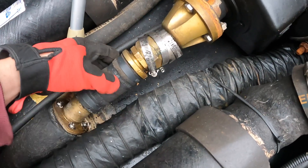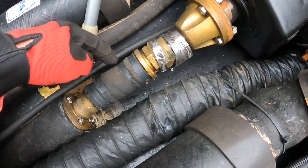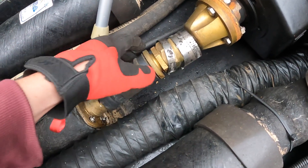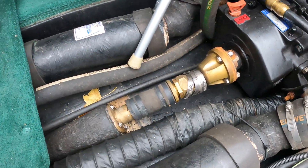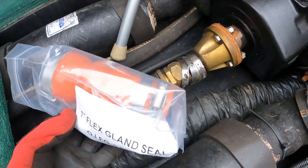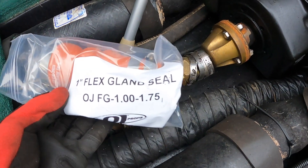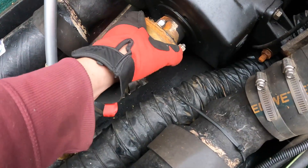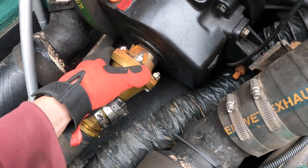This is one of the old rope seals. You could repack it, but at this point the rubber is all deteriorated so you'd need to replace the whole thing. What we're going to do instead is use a newer product — this is a flex gland seal from OJ Props. They come in a bunch of different diameters. First thing you have to do is disconnect the coupler right here.